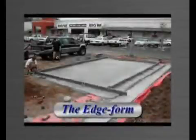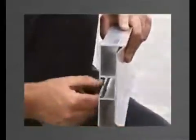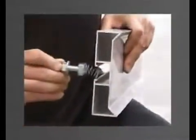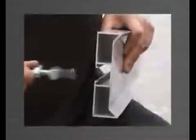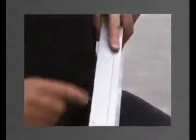The edge form is an extruded aluminium section used to form up the perimeter edge of the panel. Panelware uses a structural grade alloy and a 3mm wall thickness, ensuring the edge forms are strong and durable and will not bow when in use. Designed with the edge form is a continuous track opening to the back — this track accommodates a 12mm stud bolt, which is inserted sideways and turned clockwise to be engaged and locked into position.